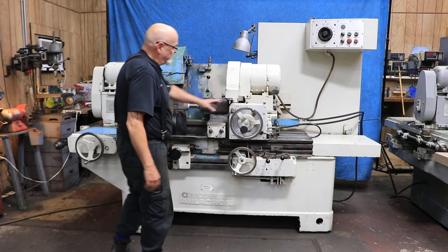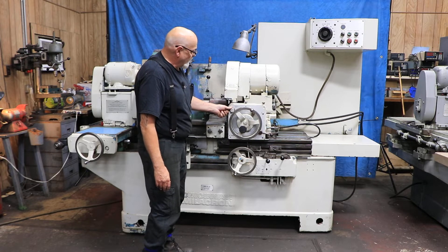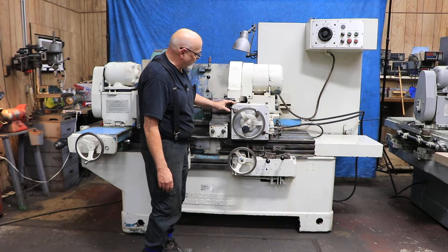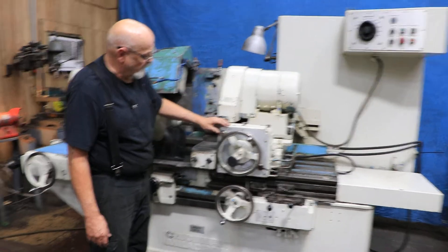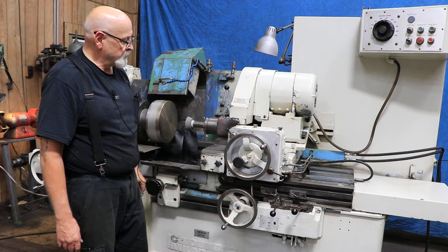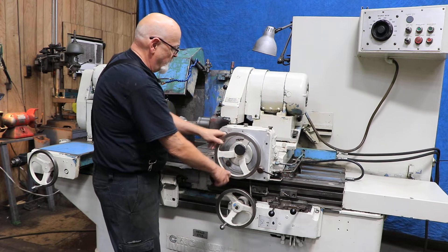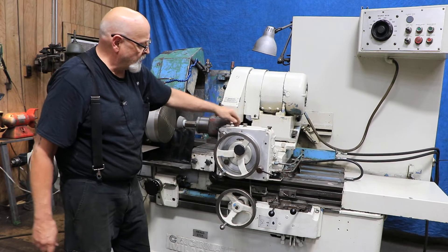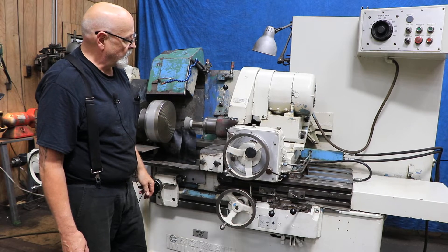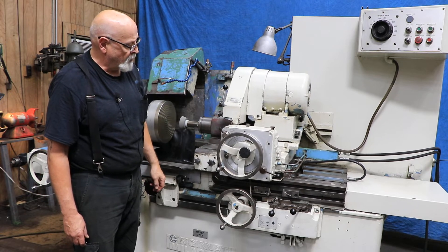This is your in-feed box. Right now I have this lever down — this is off. As I open this up, we start to feed. See how that feeds in and out. The more I open it, the more it'll feed. It'll get to a point somewhere before zero that you can set a fine feed. So we're going along at this amount of increment each time, and when I set this little setting, you're going to see right here we just slowed it down to a very fine micro feed.